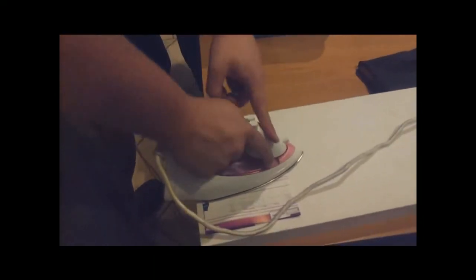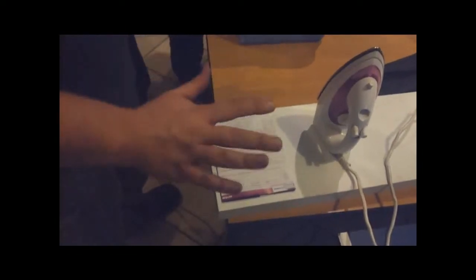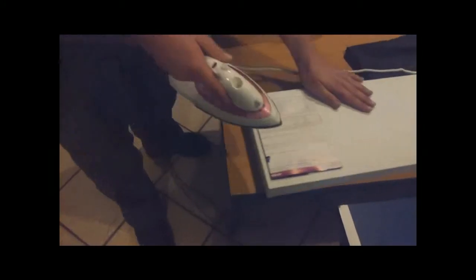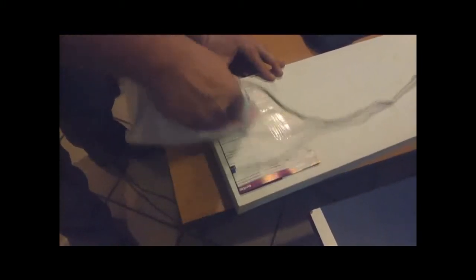Now usually for me, this time is just about enough there. I didn't time it. Then you leave it just for a second, just to bond. And that was just a clean lift, eh? That was a clean. Can't tilt it or anything other than smudges. Otherwise it smudges. Then the next step, and that's the one that actually does the most of the bonding, is to, let's do it this way around, is to just use this edge of the iron and then go over the board like that.